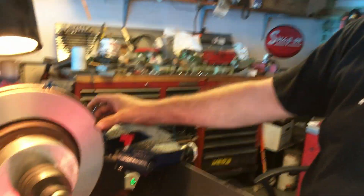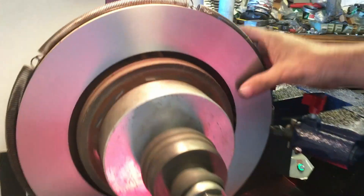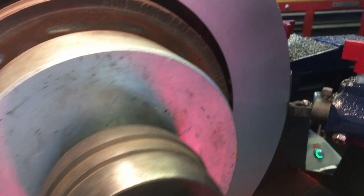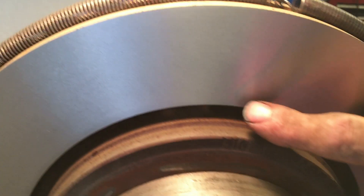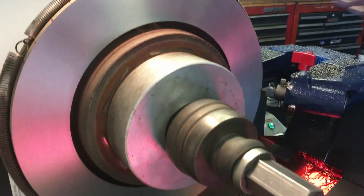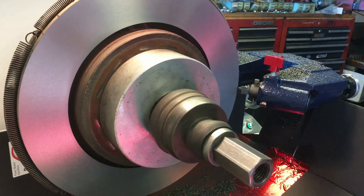The cut is awesome. There's no such thing as feel-o-vision, but that is a really nice cut — like that goes on a car, it's gonna break in the pads beautifully. Notice that it's consistent start to finish on the cut, and that's because the cutter head and crossfeed carriage is more stable.